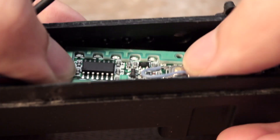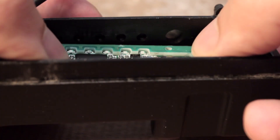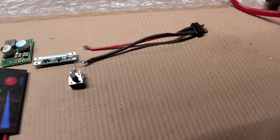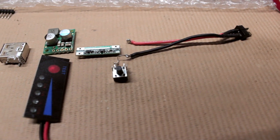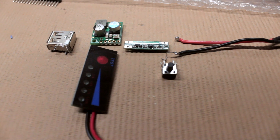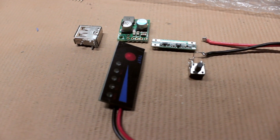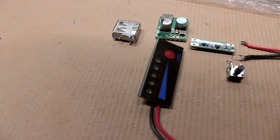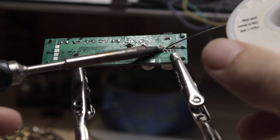Anyway, with this board as the start of my circuit, I can force the battery indicator to be permanently on by using a jumper wire so it thinks the button is always pressed. Then I can just wire the 5-volt step-down and indicator boards in parallel, so when I toggle the soft latch, both of them will be turned on. Now it'll also be easy to see if I left the USB port turned on too. With the plan and parts ready, it's time to get started wiring everything together.